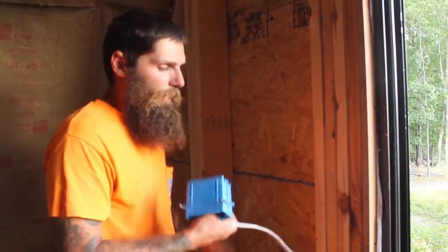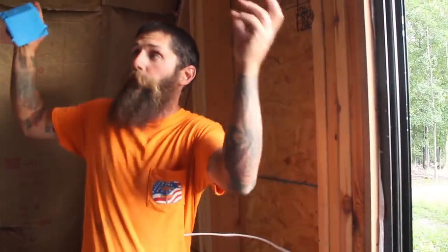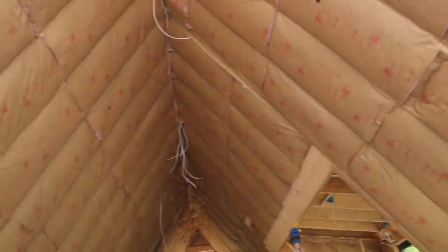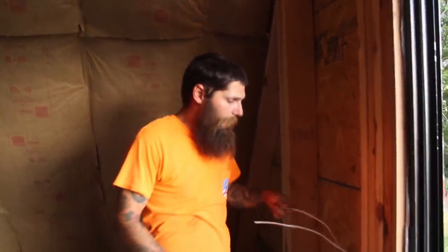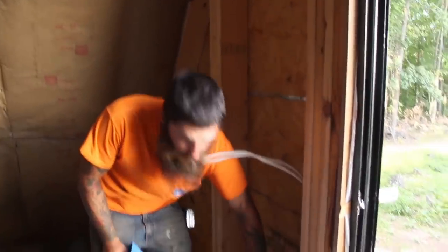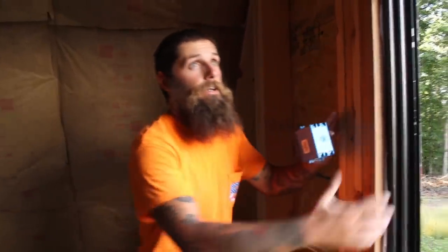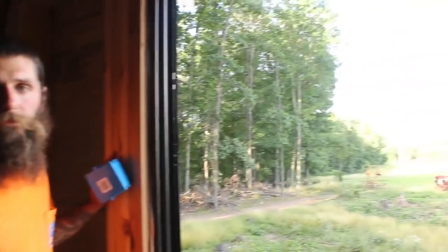So we have two sets of wires right here. We have travelers for our cove lights — these cove lights are actually going to go in the wood and be indirect light that goes up on both sides and lights up the ceiling, then glows and lights up the floor right here. The next set of wires is for the chandeliers — we're going to have two chandeliers hanging down. We also have a third switch: I'm going to steal power from this receptacle right here and it's going to be for the outside lights hanging off the side of the house, because there will be a deck off the front here.